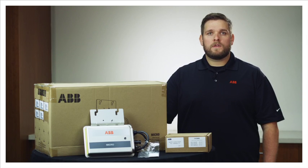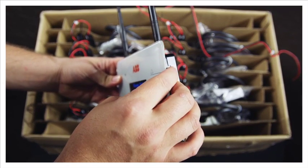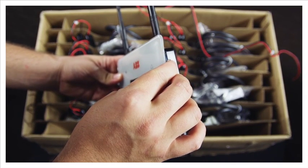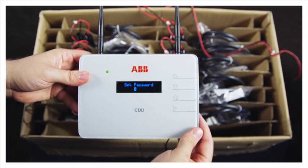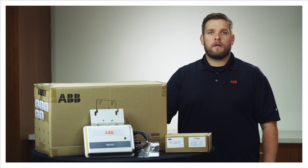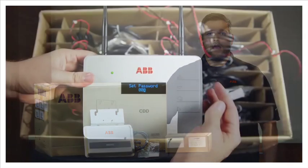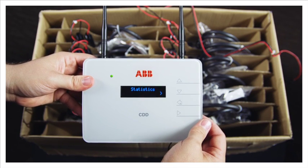In order to get the acquisition wizard, press and hold both the up and down keys simultaneously for three seconds. This will bring up a password prompt on the display. Press the up and down keys to navigate through the numbers. Click enter to advance to the next number or the escape key to correct an error. Enter the password 0010 to access the advanced menu.